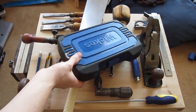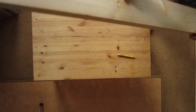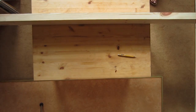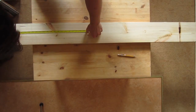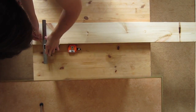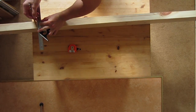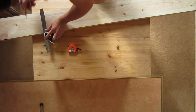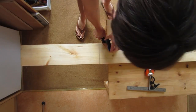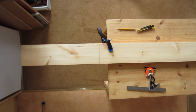Oh yeah, screws — you're gonna need some drill bits, because most of this is done with screws. So let's get started. I started with the workbench top and worked my way down. This is made out of 6x2 pine. If I was going to do this again, I'd probably use something a little bit tougher, harder, but this was cheap and it was available. The top was made from three pieces, about 55 centimetres long, which is roughly 21.5 inches.